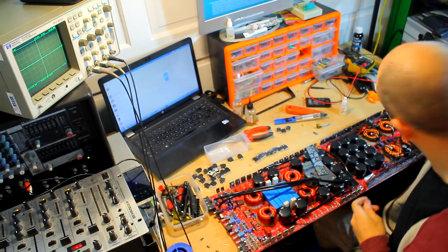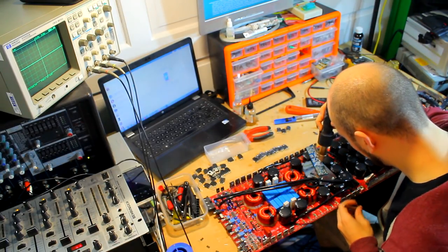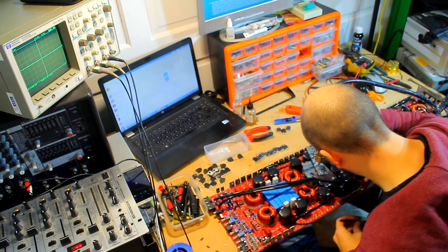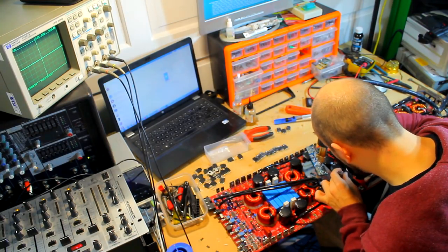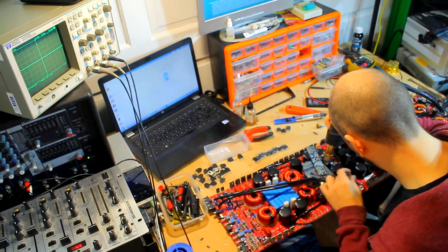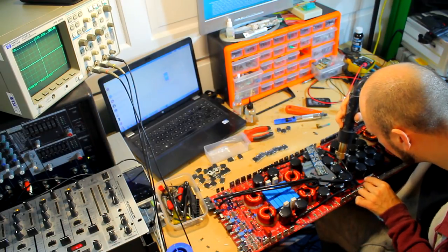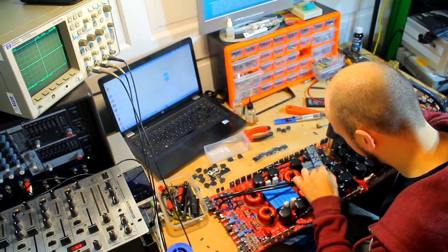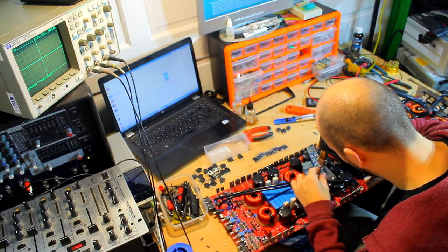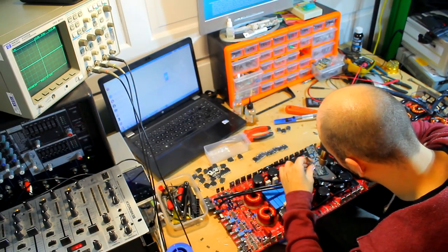Heat up the board, and then we're going to drop the IC on, making sure to take note of the orientation of the IC. It has a little arrow there next to pin number 1, so we need to get that right. Whoops. And this makes the IC upside down with the text, and that's the same case for all of them. It is incredibly important you get the orientation correct, otherwise things will end badly.